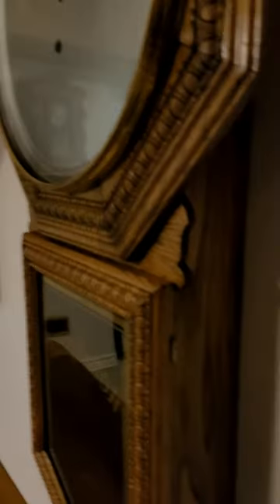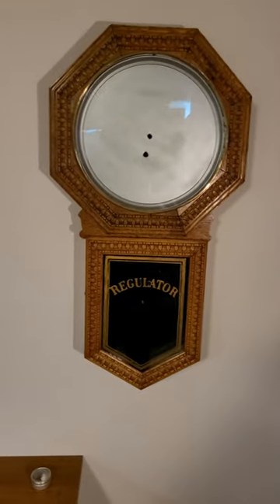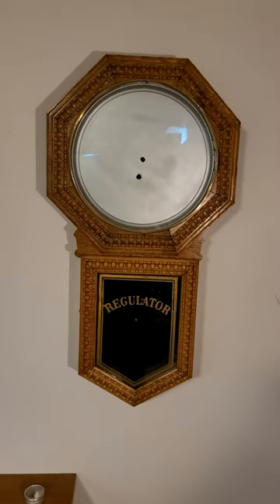Here's a picture of the side. Turned out really nice. There's all the moldings there. Came out really nice — a nice honey gold oak color. Once it's hardened up, I'll rub it with paste wax and four-ought steel wool and it's going to be just gorgeous.